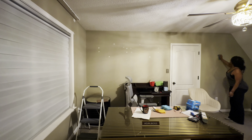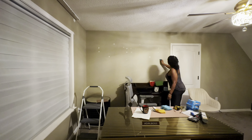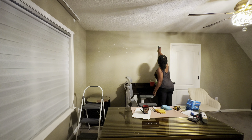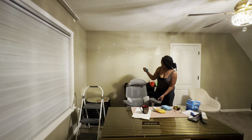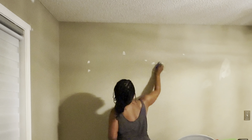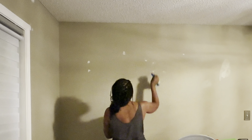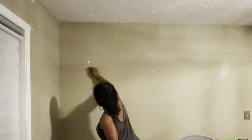I've been painting and repairing nail holes for quite some time, and I've learned and taught myself some techniques. One technique I've come up with — it may have been around before, but I know it works great — is that instead of sanding my nail hole repairs, I just take a wet towel and wipe across it, because I do not want to change the texture of my wall by sanding such a small hole.